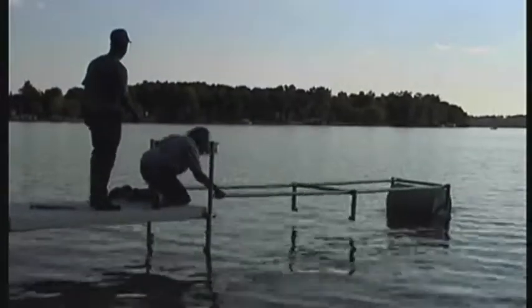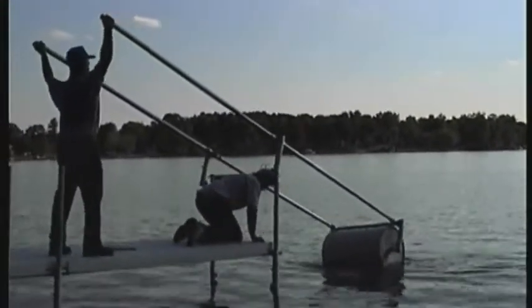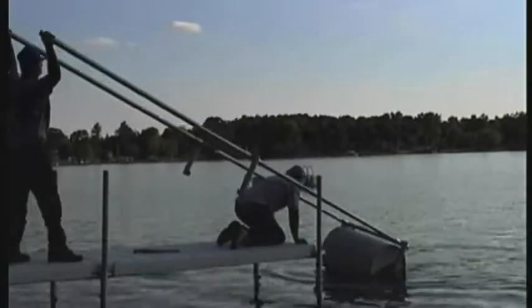While lifting the framework with your arms raised fully above your head and pulling it back, you will need to offset it to one side to avoid hitting the vertical pipes that are in place on the remaining sections installed. Failure to raise it high enough could cause hand injury with contact to the vertical pipe.